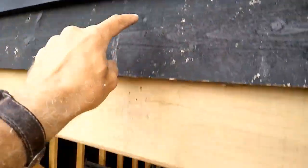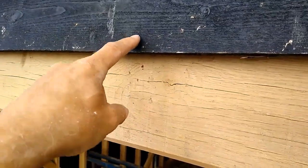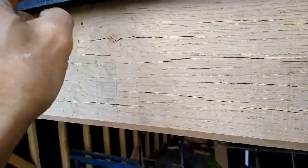I've fixed this at the top and now I'm just going to put some fixes in the bottom. I'm not going to nail this — I'm going to pre-drill it and use some stainless steel screws because they'll go through my spacer behind and into the oak.